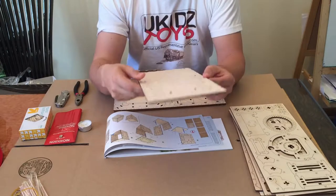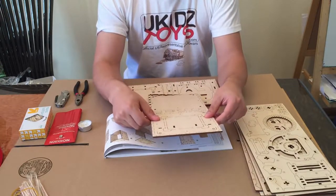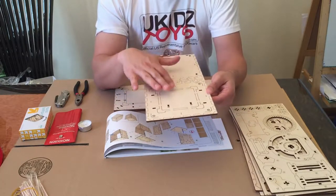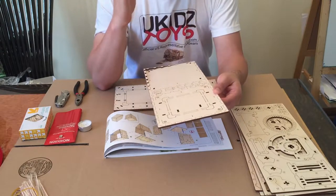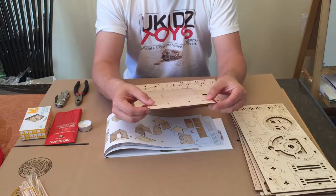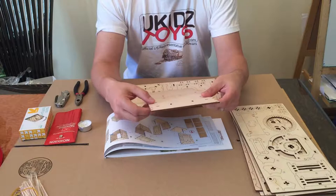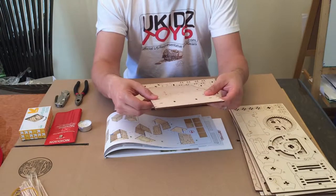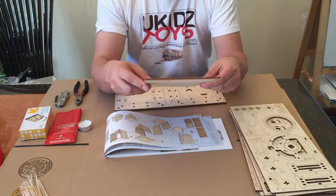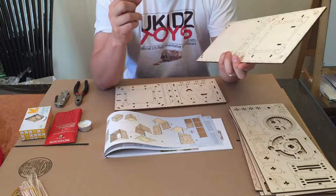As a recommendation, when you push the parts out, push them from back to front, unless you're planning to use that back surface as the front face on the assembly. So pretty much whatever's gonna be your front, put it away from you and push the part out that direction. That way it will help you eliminate any kind of peels or marks on the plywood, and it's gonna be a nicer and neater part after you're done with it. So those are little tips with the boards, and we're gonna go ahead and start.